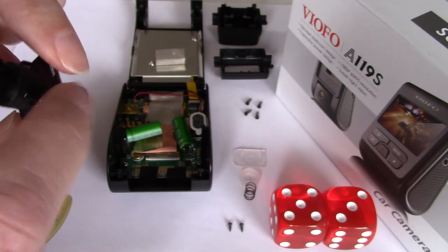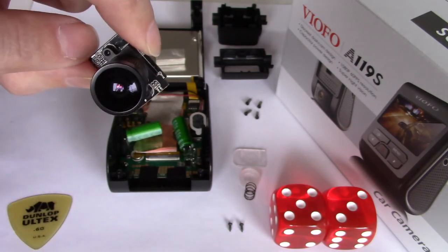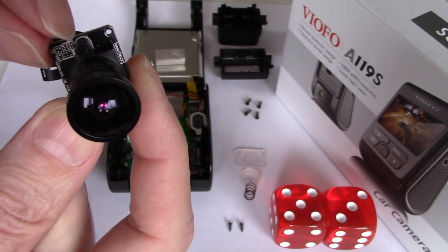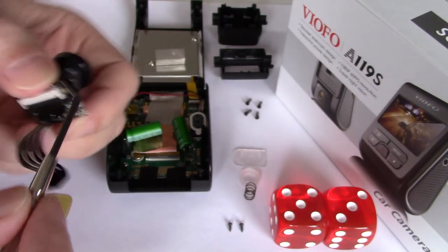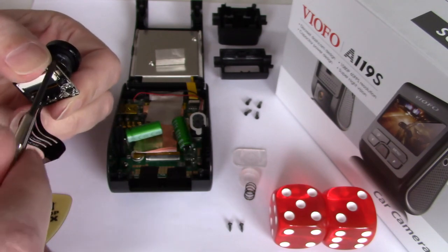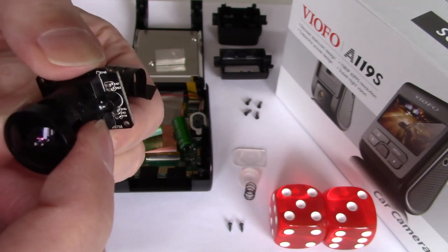What we're trying to do is shift where this notch is. We're trying to shift the housing by loosening the screw over to the other side so you can gauge it with the outline position on the circuit board — the amount of white you can see — and we want to reduce it by shifting it over. You're going to loosen the two screws, not take them out, just loosen them maybe a tenth of a turn. Note how hard it is, because that's how hard you should tighten when we reassemble.